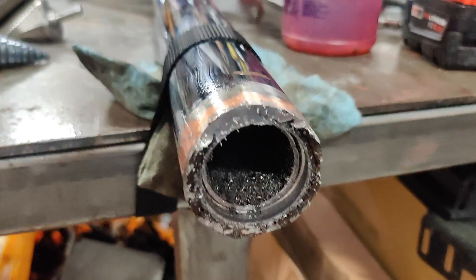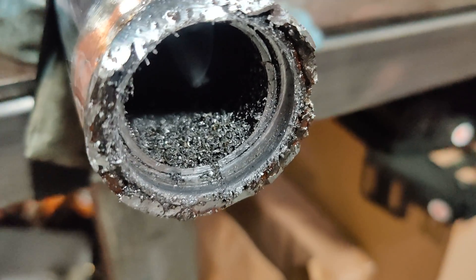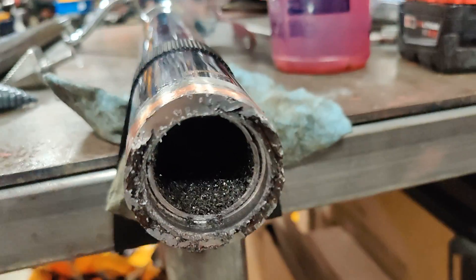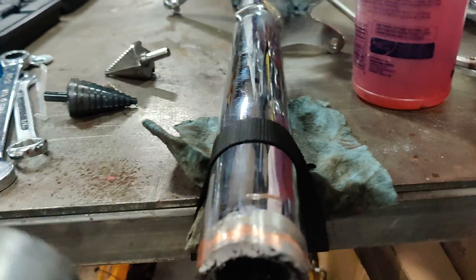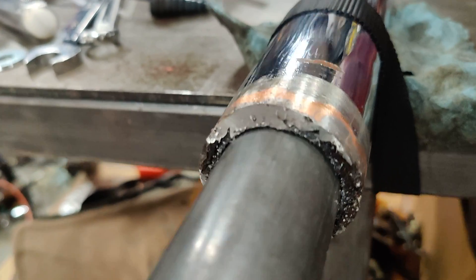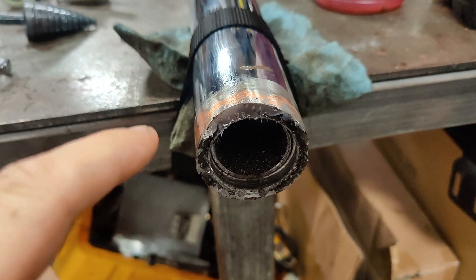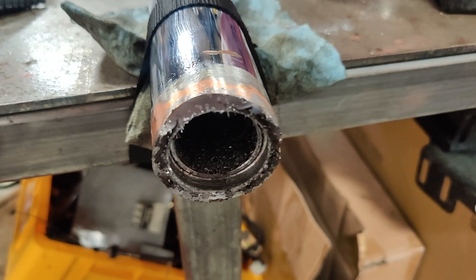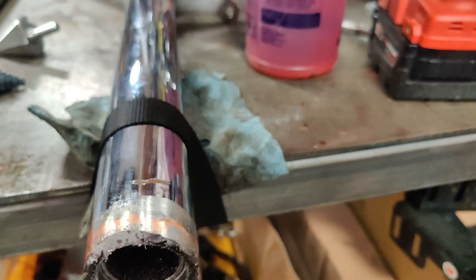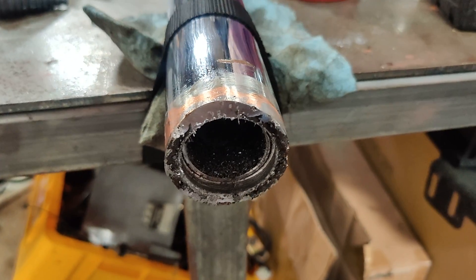It's going to be slow and I don't know how far in I'm going to get, but it does seem to be working pretty nicely at just removing the old sleeve. The new sleeve is sliding in, so that's going to work. It's just a matter of how far in I can actually drill before I either ruin the hole saw or something else happens. By the way, this is just Marvel Mystery Oil I'm using as a lubricant for the bits.